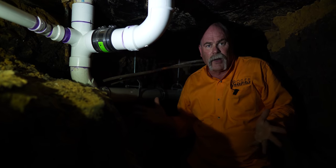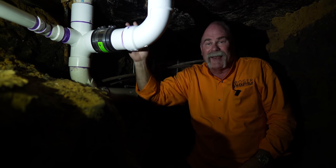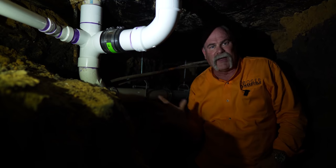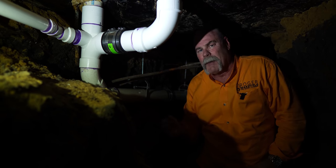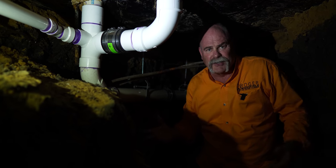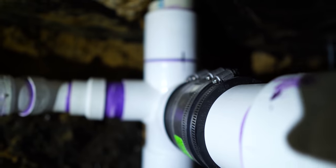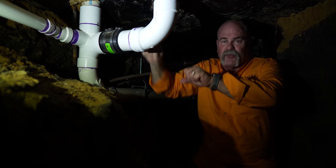Here at the end we have the restroom coming up to catch the toilet, a line going up for the vent and catching the lavatory upstairs, and an inch-and-a-half line catching the tub. We wanted to make sure everything in here was rebuilt because with so many breaks we didn't know what else might be under stress or might already have stress fractures. Our whole plan was to come in, replace everything we could see and get to, and put it in stress-free.